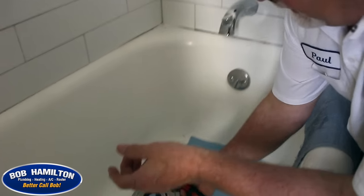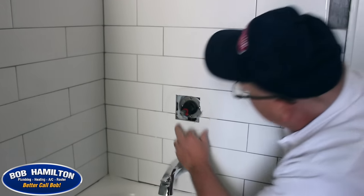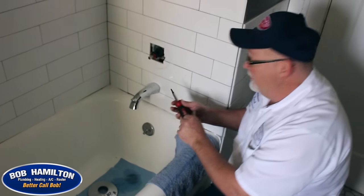It's sure going to save you a lot of grief at the end. Now looking back inside where the faucet is, you're going to see two more screws. We already have the water off — any time you start getting into a faucet, you want to turn the water off. With a tub and shower, you're usually going to have to shut it off down at the main. On a sink or toilet they usually have an isolation valve; a shower normally doesn't.